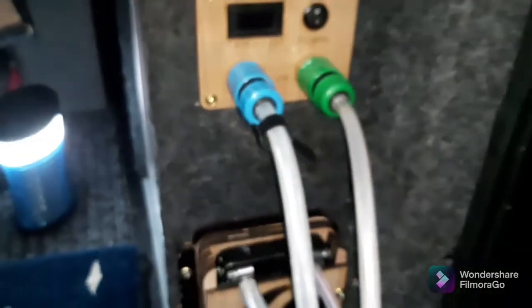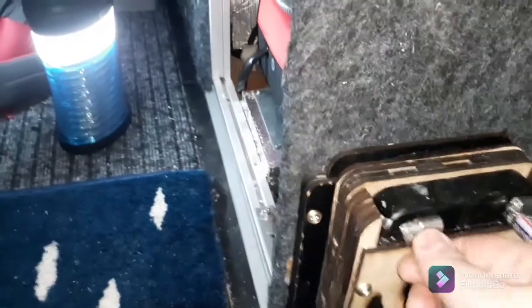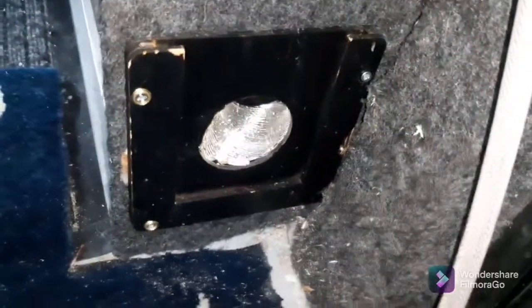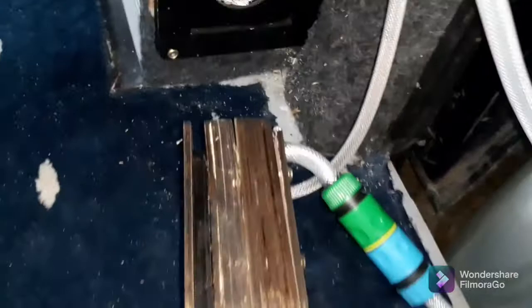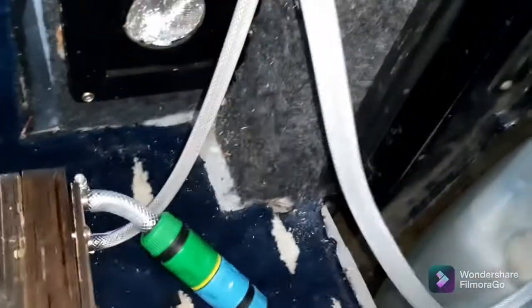There is virtually no heat loss at all coming out. I'm going to turn that off so the pump is off. This thing's going to be a bit toasty — in fact it's very toasty. Bloody hell, that's hot. In there is the heat exchanger, and this is just packed up with bits of wood. There's the heat exchange — the hot air is coming straight out of there and going straight into the heat exchanger.